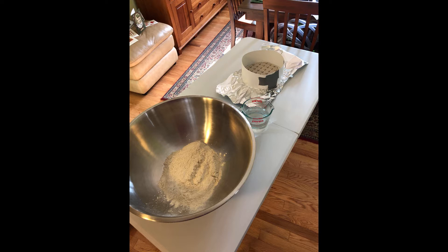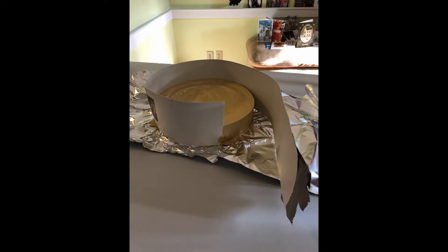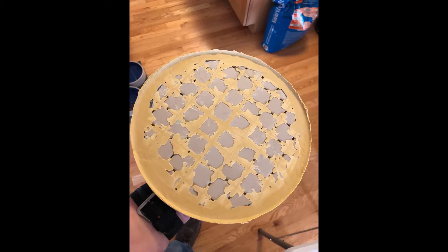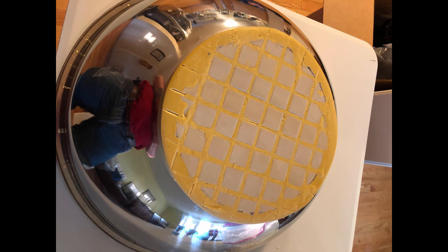Once that's mixed up like a fine paste or a very heavy slurry, you can pour it into the mold and then walk away for about 10 minutes. Before it's completely solid, it's good to remove the mold and then take a scrubby sponge and remove the material from the tile surface and smooth out the edges a little bit. You'll probably see some pits that need to be filled — you can make up a separate batch of dental stone to fill those. If you need to make notches in the tool, just take a carborundum sharpening stone and carve between the tiles where the dental stone is.